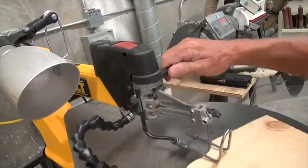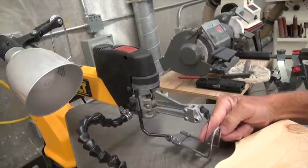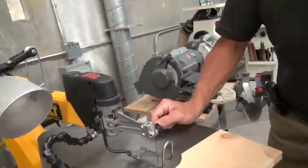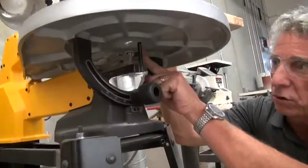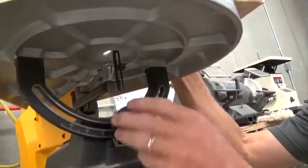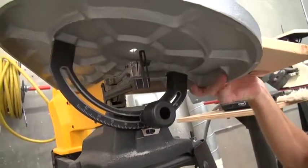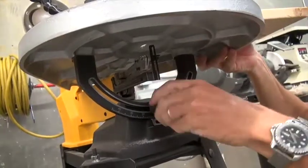So what I want to do is I'm going to loosen the tension, and I'm going to release the blade. There we go. And now follow me down here. We're going to go under the machine, just like the bandsaw. We have it down here. So if I loosen this, I could take the blade out. The other thing that we have down here, while we're down, I can loosen it and I can tilt the table. So I can cut at different angles.